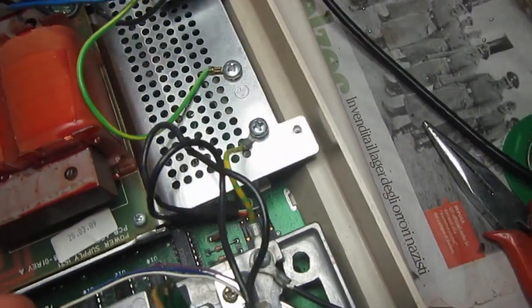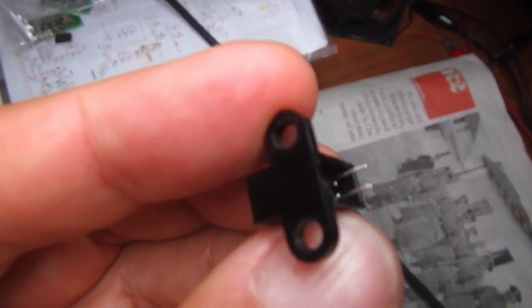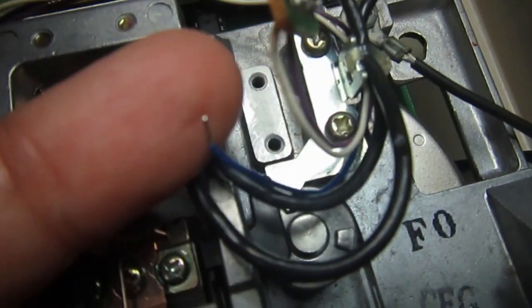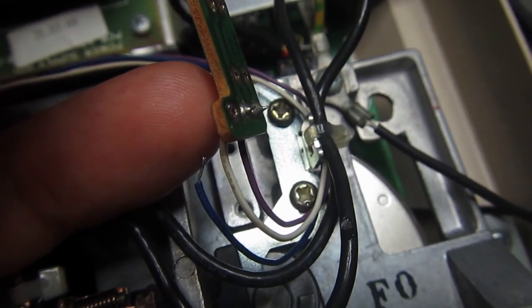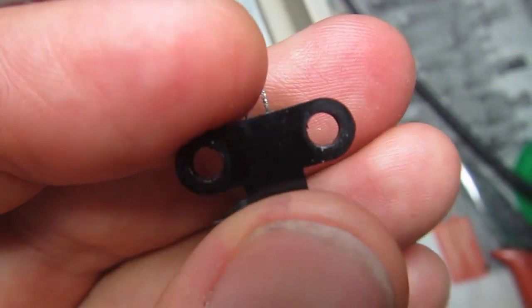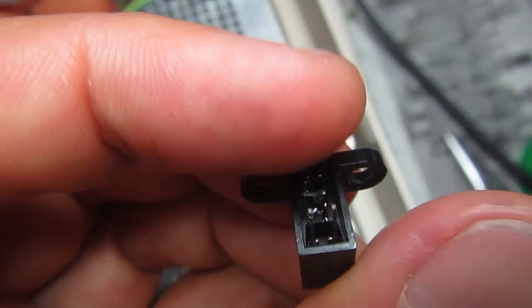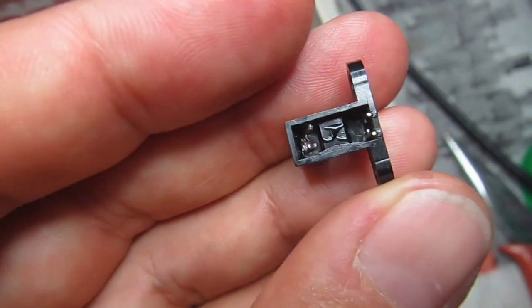I de-soldered the complete assembly to check it without the blue wire connected. The external circuit looked good but could have been driving to ground. After removing the whole assembly, I found that the legs of the photo diode were barely exiting the plastic package — they were apparently never soldered in. I'll solder two additional legs to the photo diode, reinstall it, and see if that's the only problem.